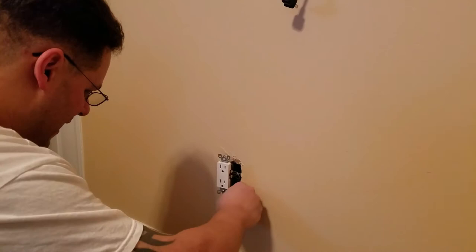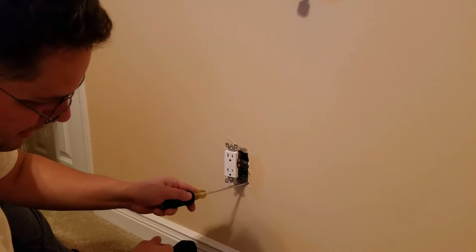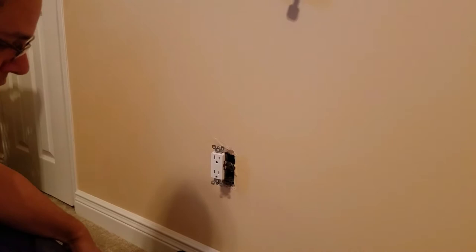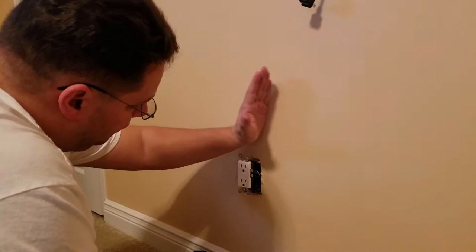There's nothing here — this goes all the way on an angle. See, it's not moving and you can actually ride the two-by-four. Obviously you're going on the outside of the box or right below it on the outside. So now I know the two-by-four is on this side. When I take the TV off and measure from left to right, I can put the box as close to the two-by-four as I can, and it will still hide behind the TV.